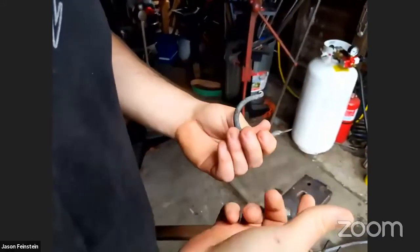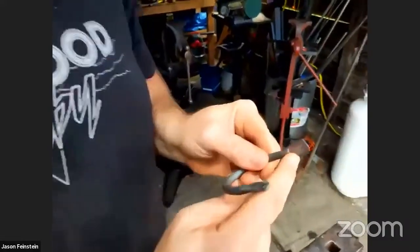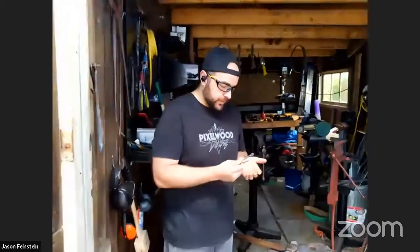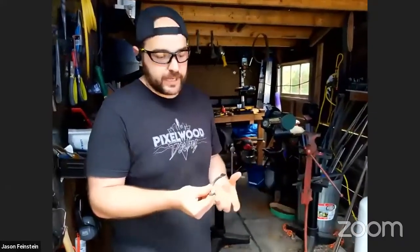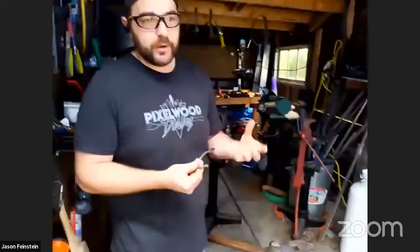Also, we're eventually going to need to cut it off the material. So we've got this long rod here. We don't want a hook that long exactly. So let's cut it off. And then we need to make a little backing plate that we can drill a hole in to put the screw in that will go in the wall. The question is, what order do we do those? Cutting it off the bar first wouldn't really work very well, because then we'd have a teeny tiny piece that we would then need another tool to hold on to it with. And we do have that tool. We've got some tongs here. But I don't want to do the entire operation using tongs. It's much easier just to hold on to the bar. So we'll save cutting till later in the operation.